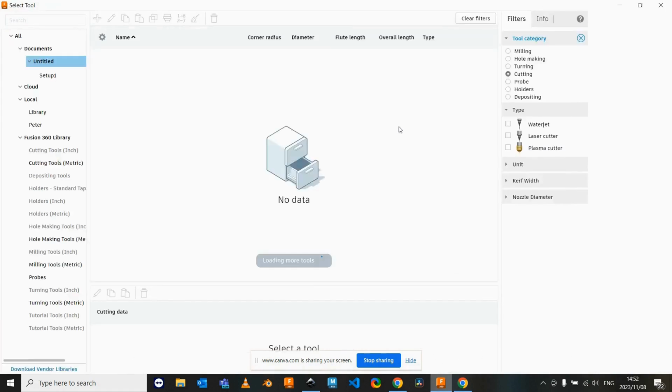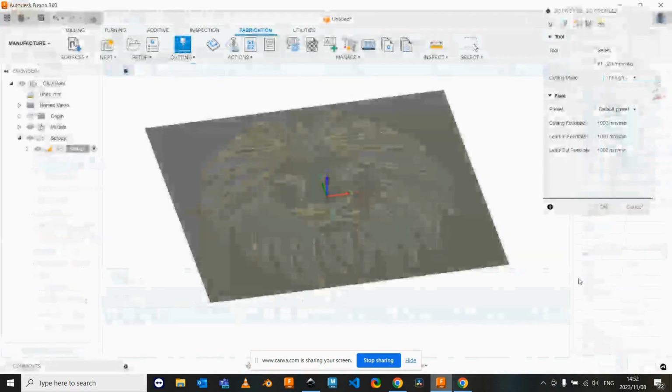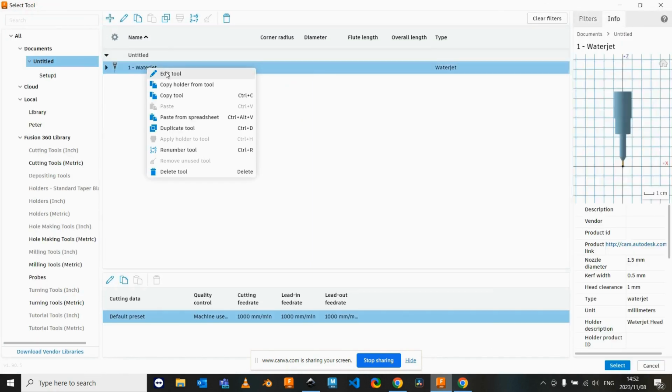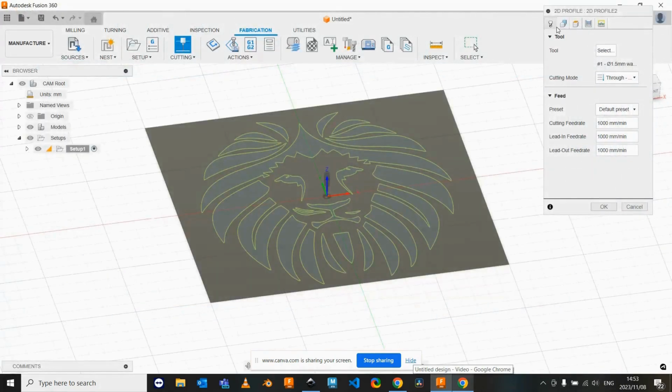Our next step, into our geometry tab, it's now asking us to select our contours. So I'm going to start off selecting the contours that I wanted to machine. Okay, so we now have a green tick and Fusion has now calculated our toolpath. When I say simulate, we can now see, and there we go. So I found it to be a nice, quick, easy way in order to take a company logo, a JPEG, a PNG, easily trace it over, bring it into Fusion, and throw toolpaths on it.